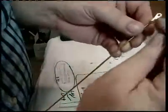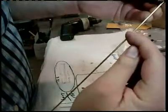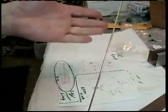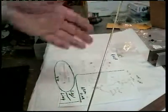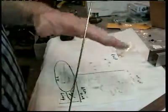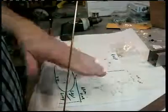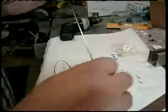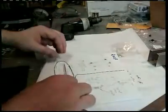The length from the center of that hole to where we want to make our cut is going to be 3 5/8 at the longest. If you went 3.5 inches, that would work too. But you wouldn't want to go more than 3 5/8, or there wouldn't be any point ever where both feet, or any one of the feet, is completely sitting on the ground. In other words, the pin would always be sticking down. It'd always be a little teetery.